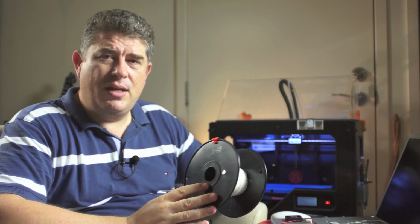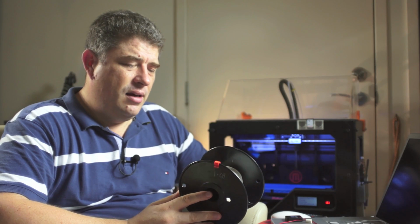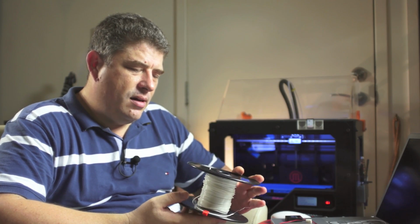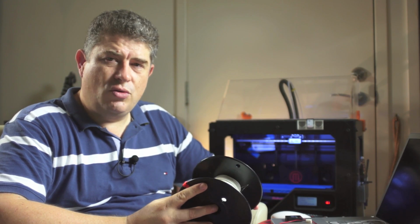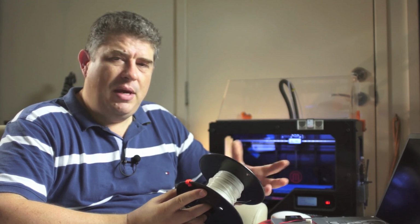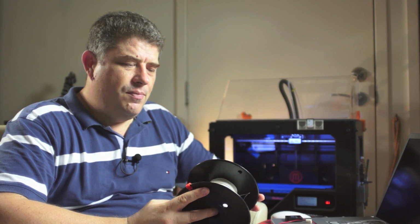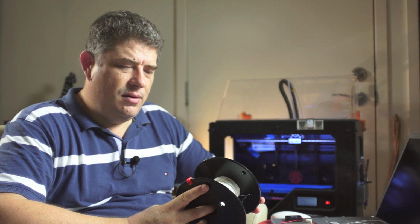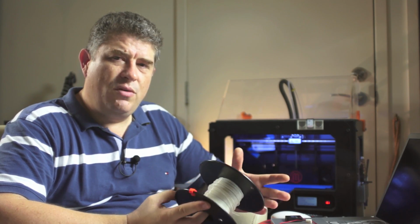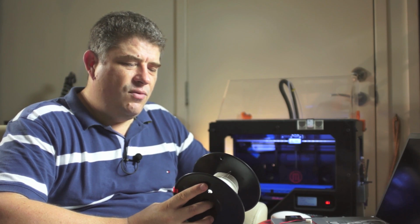And so there's a couple of things that you can do to look after this stuff. There's some debate as to whether PLA is apparently hydrophobic, which means that it doesn't absorb moisture compared to other plastics like nylon or ABS. Nevertheless, it will absorb some moisture from the air. So the thought is that it's more of a gradation. ABS is more prone to absorbing moisture than PLA, but PLA still can. If you live in a very dry climate, it's probably not an issue.